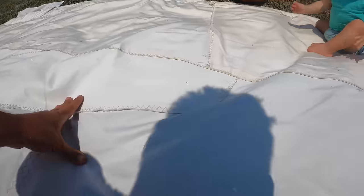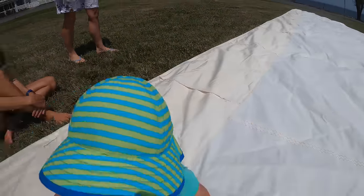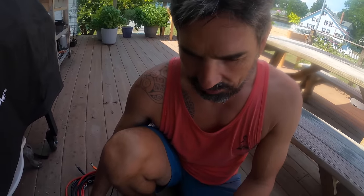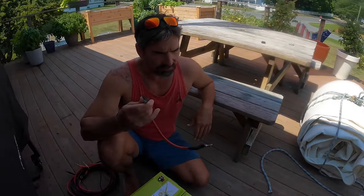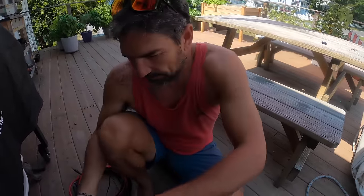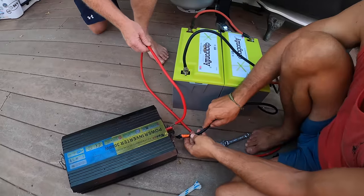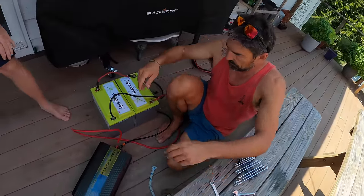The stitching is really good on all the sail — it's only this part of the UV cover. I wonder if when they made the sail they didn't use the right type of thread just here. It turned into a real boat project. We were about ready to start sewing and then realized we're in America — the power is 115 or 110 volts 60 hertz, and the sewing machine takes 220. We don't have any step-up transformers, so we had to go back to the boat. We got two lithium batteries so we can run 24 volts, got an old inverter and some wires, and we're going to make a little power supply. That's much better than a pair of jumper cables. Pretty solid-looking setup — don't do this at home.